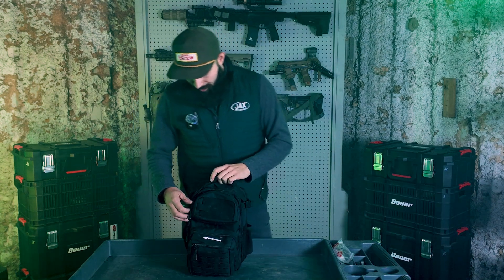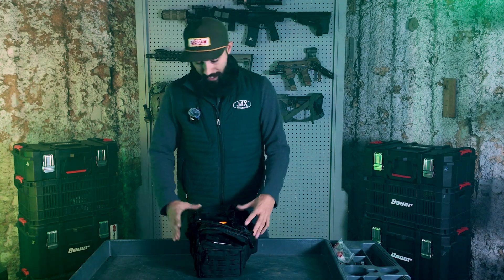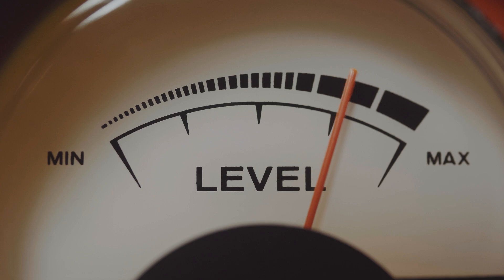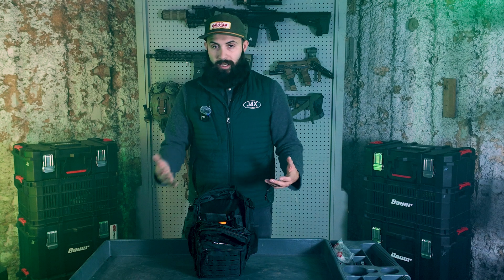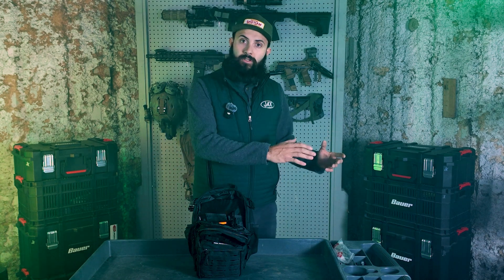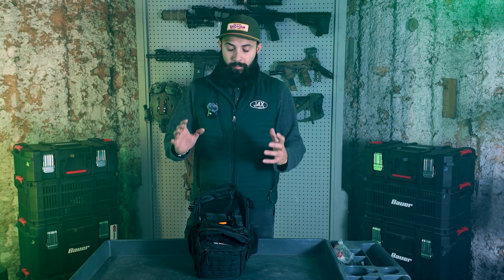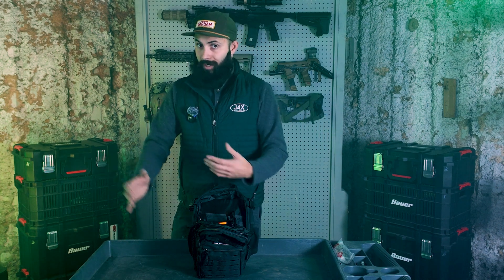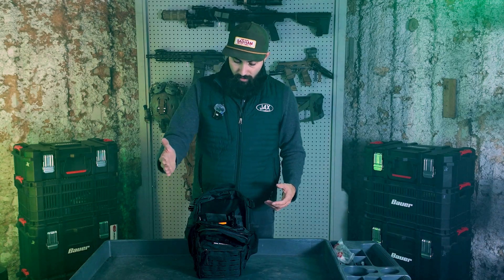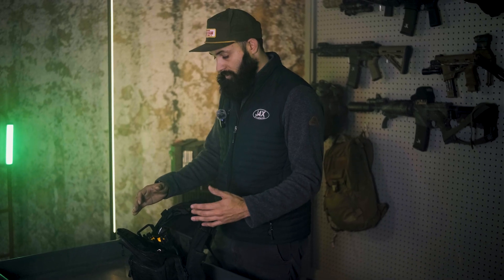Now, with sponsors out of the way, I wanted to talk about civilian ManPak bags. The benefit of a ManPak bag, as I see it, is that you have more power than you would in a handheld radio. Handheld radios typically only put out between 5 and 8 watts maximum. The best way to overcome terrain or building obstacles to get more range with your radio is power. A ManPak bag gives you the opportunity to have 25 or 50 watts — much higher wattage than a small handheld.